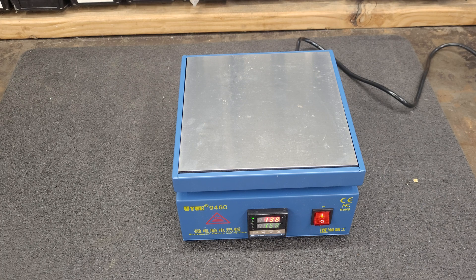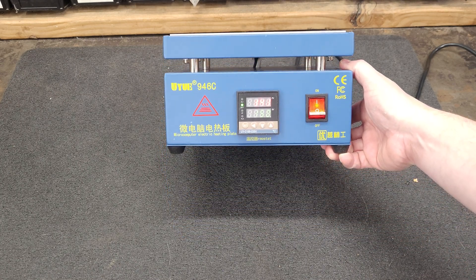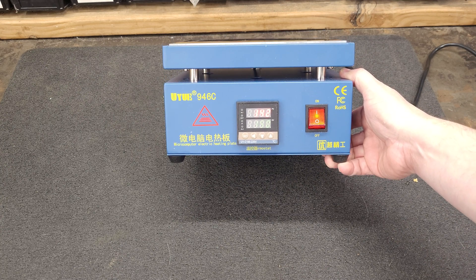If I heat the board up to about 160 to 180°C and do the installation of the capacitors, it shouldn't affect anything else on the board. These ceramic boards just suck out the heat — they have very good thermal conductivity. I can smell it; this thing needs to be cleaned and wiped down. I will check the thermocouple to see if it's screwed down tightly, and I'll also check the earth connection.